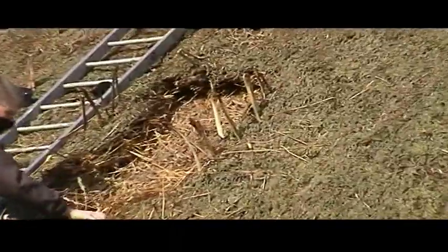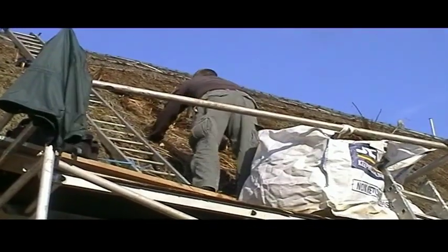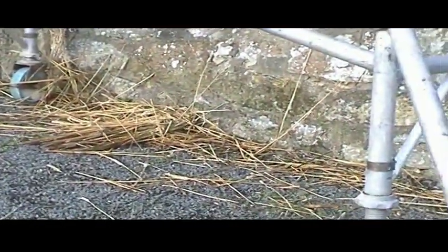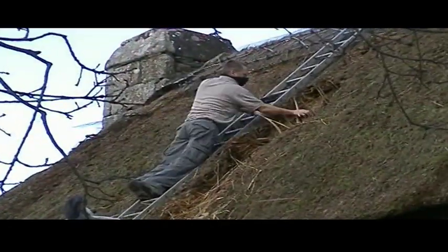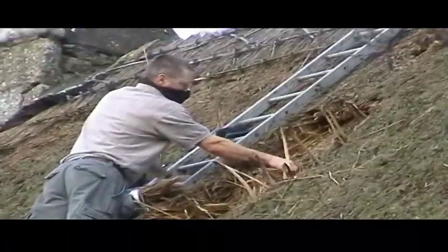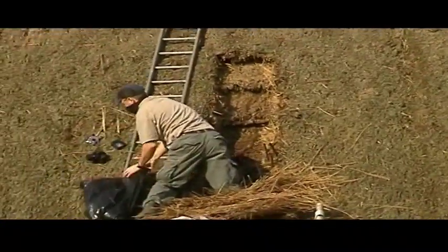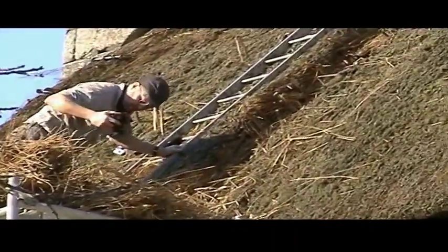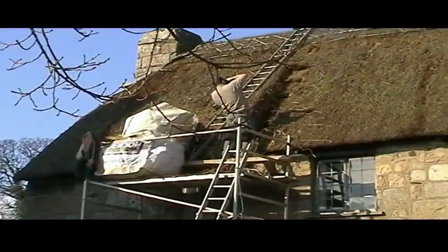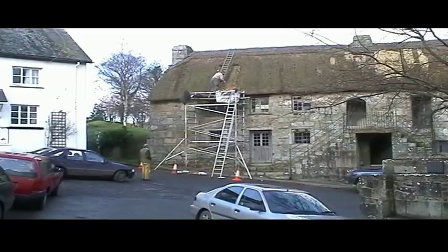An excavation of a trench about three feet wide, essentially applying an archaeological approach. You'd start at the top, just towards the ridge — you might want to do a section through the ridge — and push yourself down a couple of feet until you find the next layer. What you're working is from weathered layer to weathered; that's how you see the surface. You're recording the fixings at every layer and the material at every layer. The problem is you could get into problems with patching — maybe you've come down onto an area that happened to be patched, so it's not actually a layer. Historically people are patching in sections or patches, not just the whole face, which is what's happened in the last 40, 50 years. Usually you can see. Then I would push that trench right from the ridge to the eave. If we're really lucky we'll get intact ridges and intact eave. If not, I would push the eave slightly over just to get some idea — to try to find out how the original eave layer was fixed. That should inform how the re-thatching work occurs at the eave, if it really is a mudded wall top, which is what I would expect.